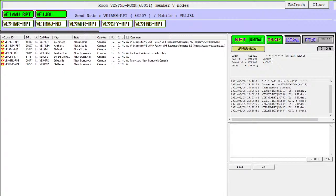I'm not sure what the topic was. I think I've got something about antennas. So I use fiberglass verticals for VHF and UHF. I have Comets and Diamonds that I use here for verticals, and I have a G5RV for HF. I do have a Cushcraft R6000, which is an HF vertical for 6 through 20. I put that up in the summertime, but not in the wintertime, so it's stored away in the garage right now.